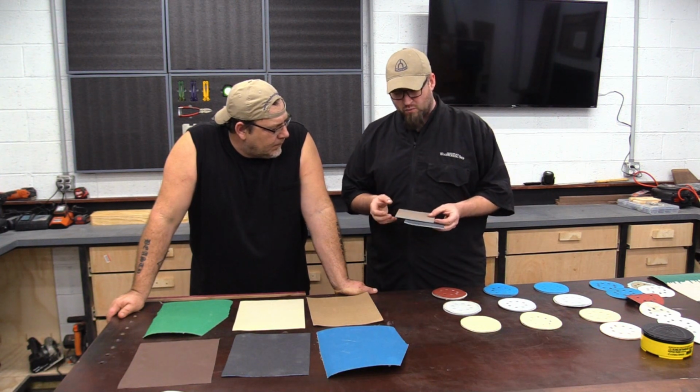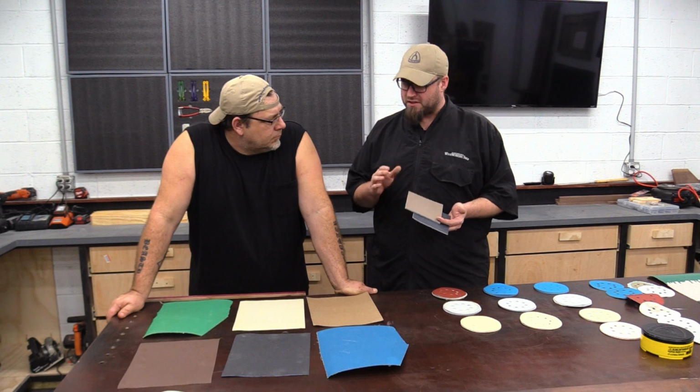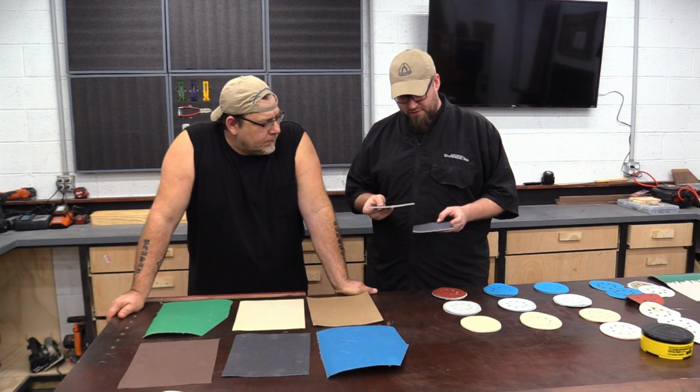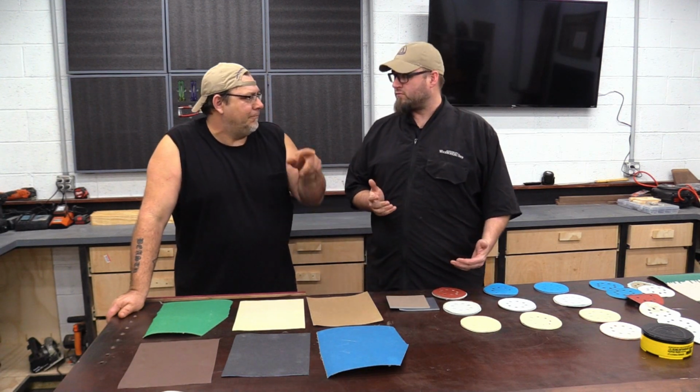Aluminum oxide actually acts more like an ice cream scoop. It kind of plows out the finish and doesn't leave it very nice. It's more like a U-shape. It doesn't give you the same surface area. I imagine the mechanical bond would be a bit nicer with a knife edge than a big old U-shape. Correct.